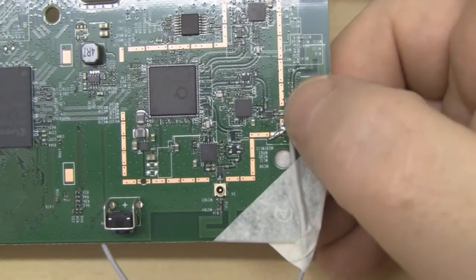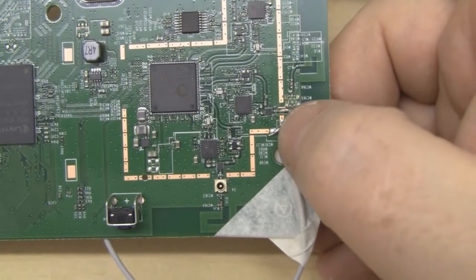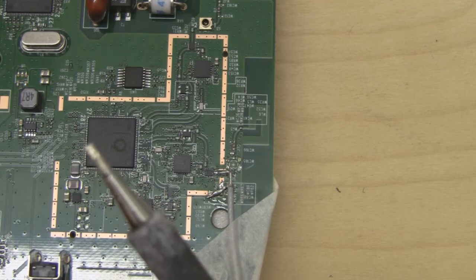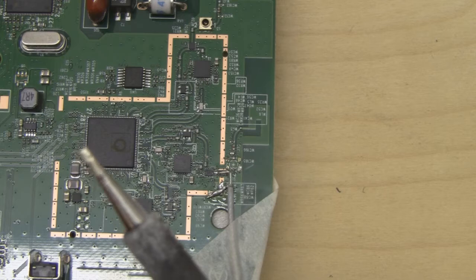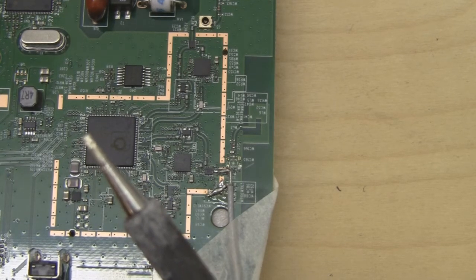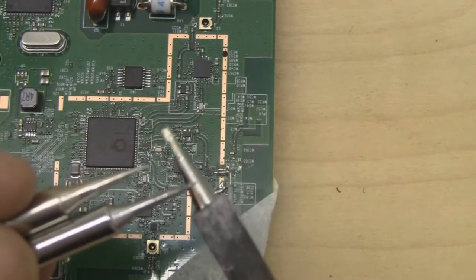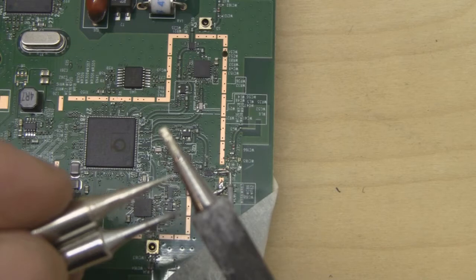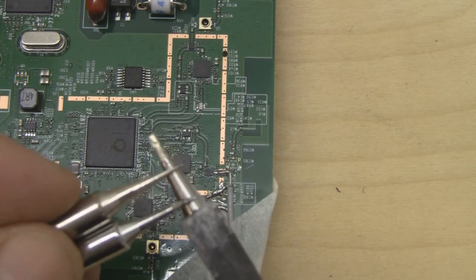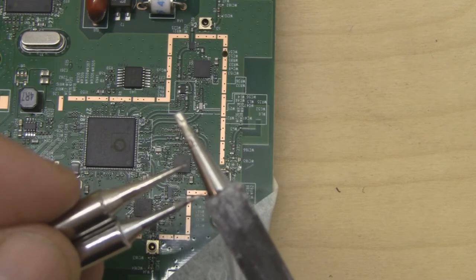The only thing really holding the coax in place is the shield solder joint, so getting it taped out of the way means you won't go back and have to repair ripped traces. As for soldering iron tips, I've got a fine chisel type on my iron. It's a little wider than what I'm working on, but it's actually the best tip for small traces like this. Needle tips — just throw them in the bin, you can't get enough heat down into the trace to do anything.